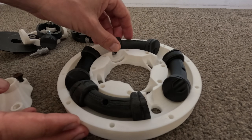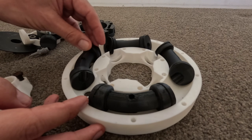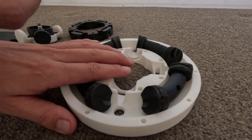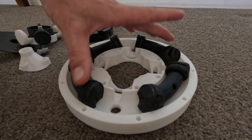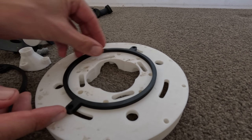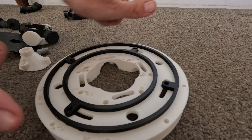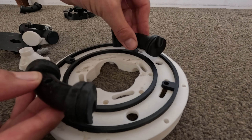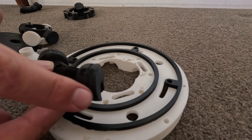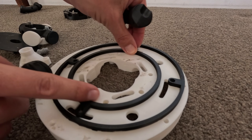The good thing about this new design is that as it's spinning, the whole thing's spinning together — so this whole motor is spinning, acting as the flywheel. The pistons are oscillating side to side, but since it's spinning, it's kind of like one of those rotary plane engines that worked really well. And that MYT motor did give me another good idea: these opposing pistons always move the same, so I can have a ring connecting them on the back here that moves these pistons exactly the same. The outward centrifugal force of the pistons will always be held central — they won't be trying to tip and twist. This ring will take all of that force, which is great.